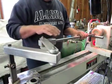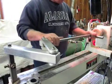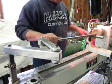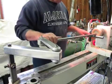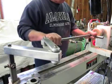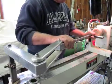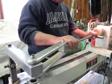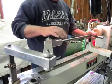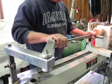Watch the action of the arm. I hold on to the clamp block with my right hand, and with my left hand I keep the heel of my hand against the tool rest. Never ever do I put my hands on the work side of the tool rest — but here I can control the motion. You can see as I cut around the corner, the motion is similar to a handheld tool, but in this case it's supported at both ends — you can see as I cut away at the bottom of the hole.